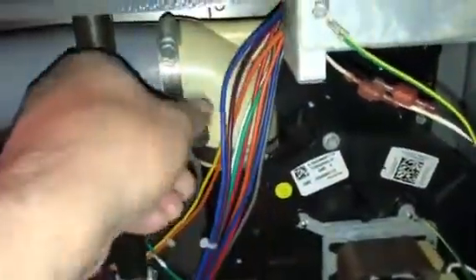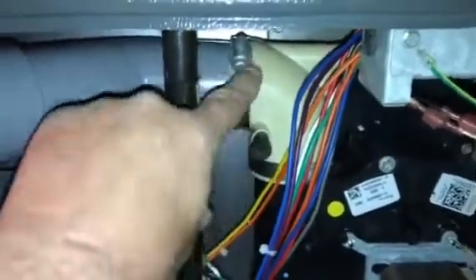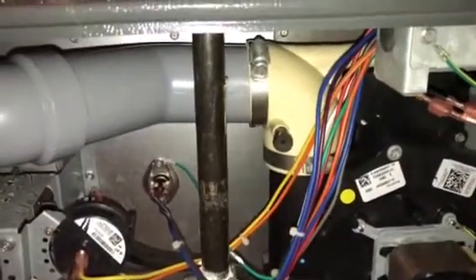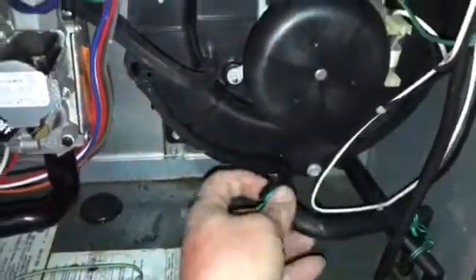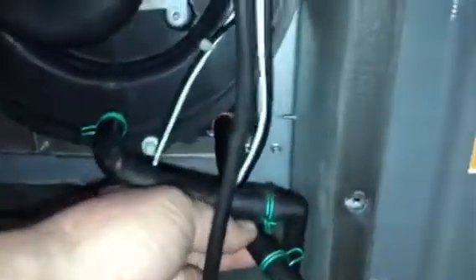There's nothing hooked to the drain for the water separator on the exhaust flue pipe, and we find it open. Goodman did stop draining the bottom of their flue motor for whatever reason — I guess they trust the water separator to do the job and not get condensation in it. There is obviously a pipe hooked to the bottom of the heat exchanger, the cold header area.